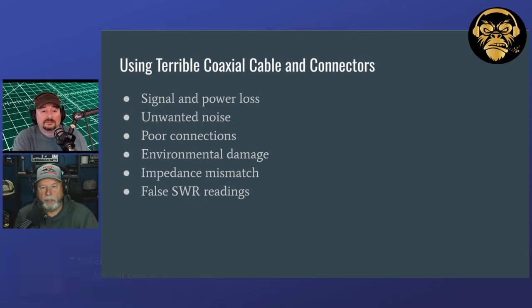The problem with bigger cable is you're not going to get as many wraps. Also, larger coaxial cable becomes less flexible, and the center conductor can travel through the dielectric when you try to bend it further than it should be bent — and that's a no-no. On impedance mismatch: a poorly made cable might not actually be 50 ohms, and that can cause problems. I've seen folks buy 75 ohm BNC connectors instead of 50 ohm BNC connectors, which can cause false SWR readings.